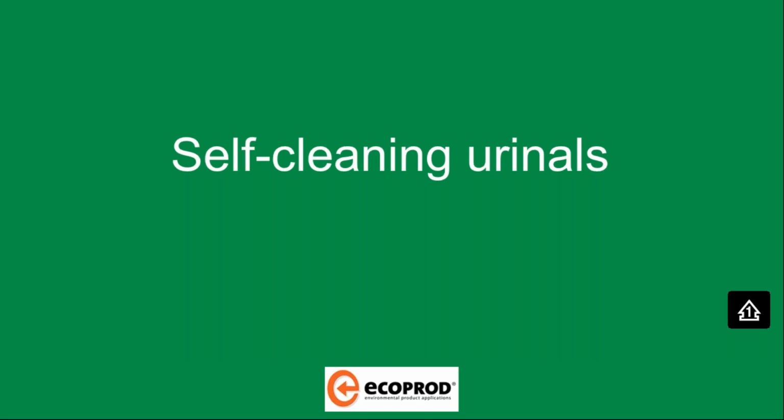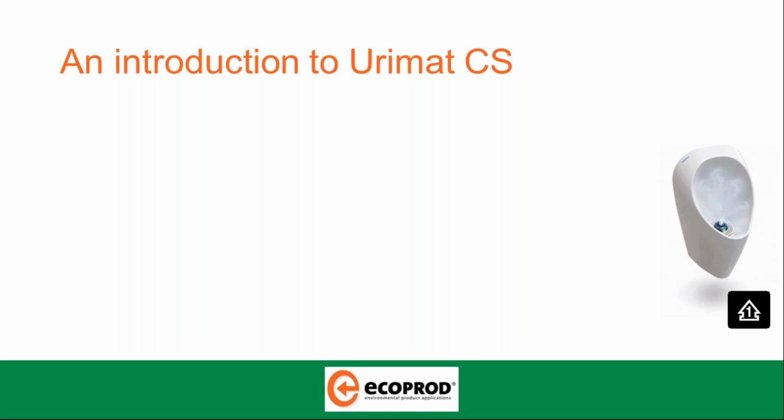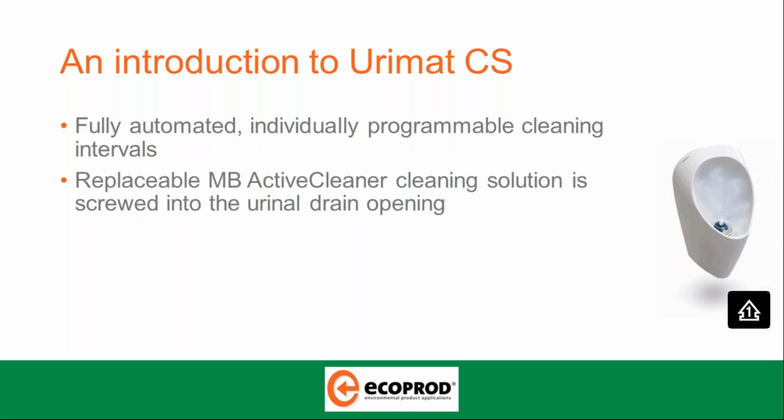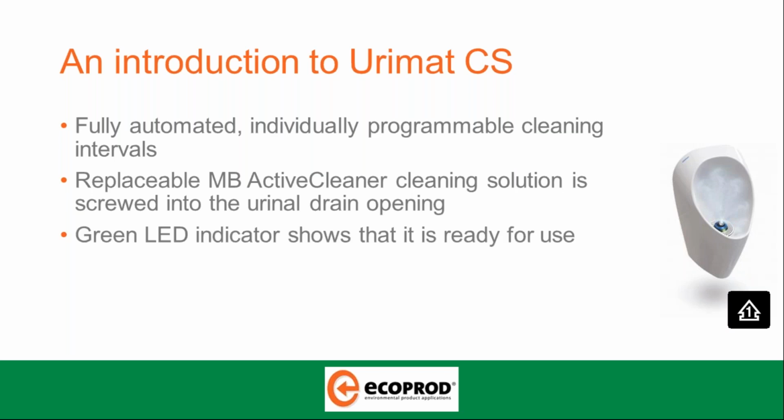Just going to touch on a new product which we mentioned in the agenda, self-cleaning urinals. This is a product that's been on trial here in the UK with some particularly friendly clients for over a year now, and it's now been launched. It's called the Urimat CS. It's fully automated, with individually programmable cleaning intervals. Replaceable MB Active cleaning solution is screwed into the urinal drain opening underneath. There are two LED indicators. The green LED indicator shows that the product is ready to use. That will flash red, advising the washroom operator that the MB Active cleaner needs changing, or the MB Active trap needs changing.